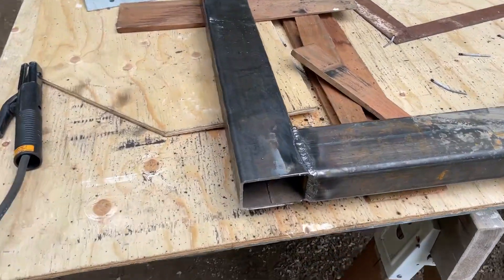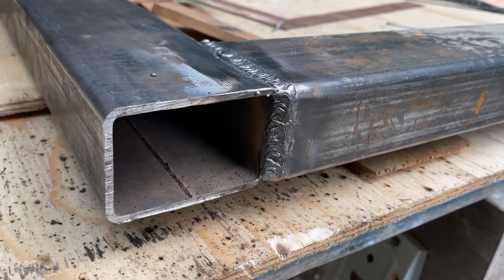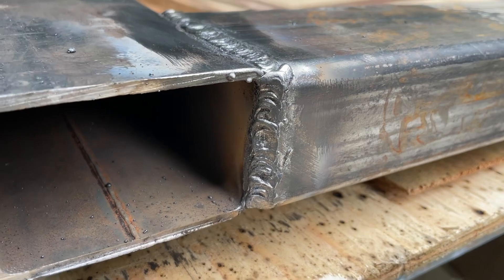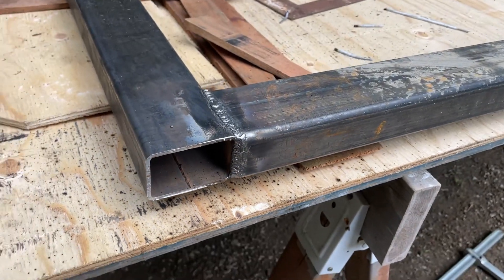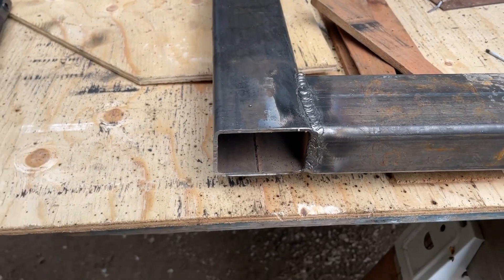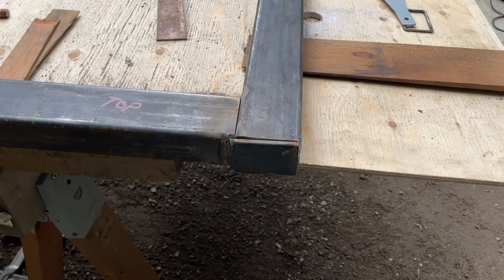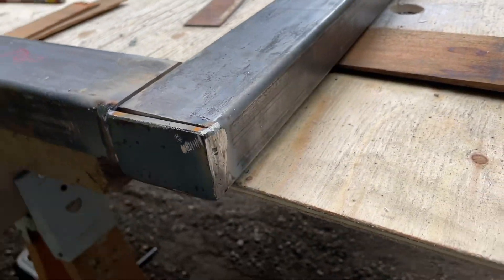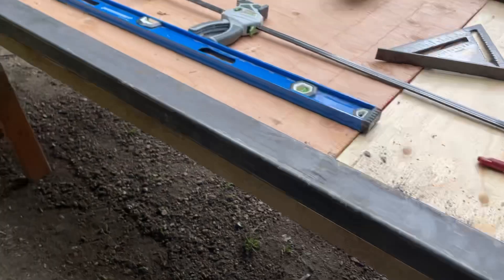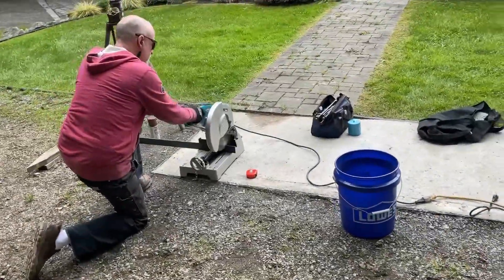So we're just welding these ends up here. Here's a little weld shot of 60-10 down. This stuff's only one-eighth thick, so just down and hand it. Put a little cap on here and we'll be good. Just like here — we've got a cap on these ends, otherwise the water's going to come in. And the other thing we're using here is a Makita cut-off saw.